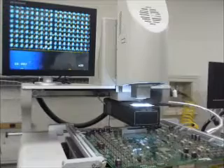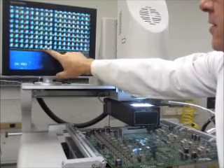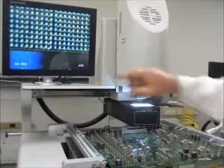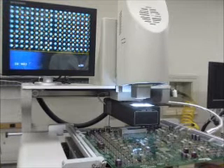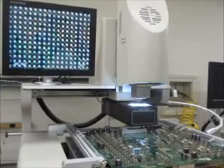We are concerned on this particular board — there are open vias. What happens is the solder gets down on those vias when you're solder wicking. There is a chance that the solder can come out and outgas and bridge. So we're going to try this one component. If we have issues with solder outgassing, we need to take the chip off and plug all those vias that have solder in them with some solder mask prior to putting the chip on. But they are open on the bottom, so we're hoping that if they outgas, they do so on the bottom, which they normally do and not the top.